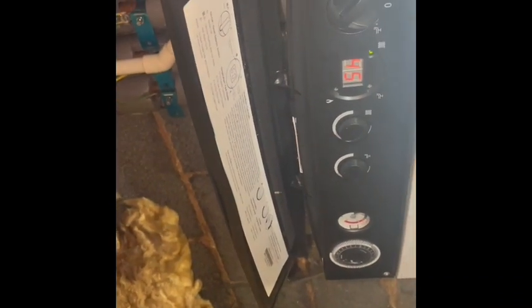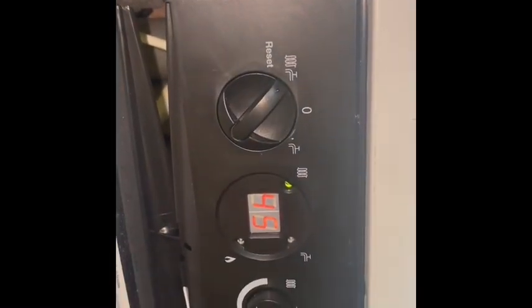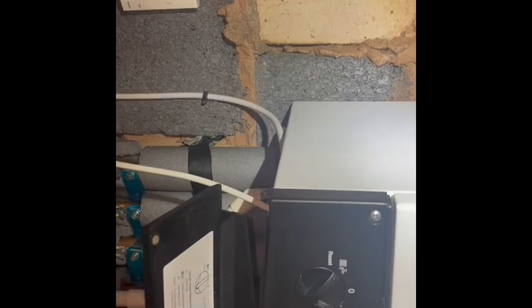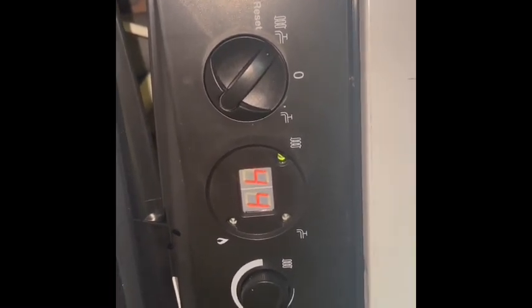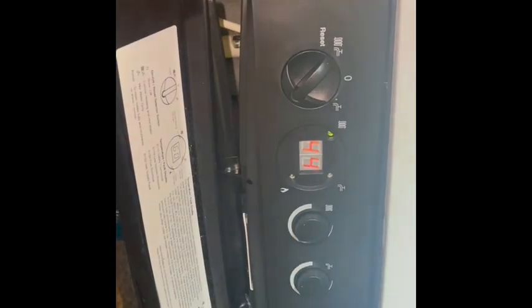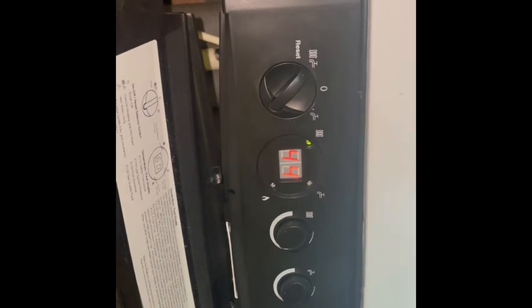However, we've developed a fault now where the radiators are not heating up - sitting at 45 degrees. The heating is on. I'm just going to wait for this to refire and see if this shoots up quickly into the 60s, 70s and 80s, suggesting a circulation problem. We've got a few radiators that warm up and some that don't, so here we go, we're about to fire.